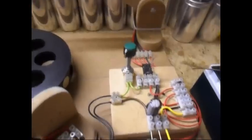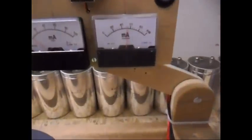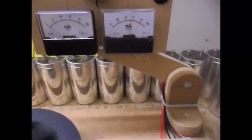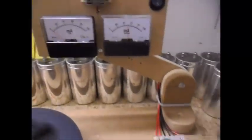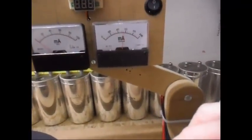Let's give it a little spin. Let me connect the wires. Spin by hand. The input is now around 50 milliamps — I think you can clearly see that. There is a neon glowing. The speed is not a record speed of course, but that's not the point here. The point is to see how much of that 55 mA I can send back to the source. And of course if I play with the potentiometer over here I can go for less or more milliamps.